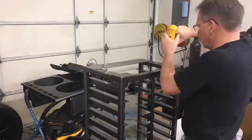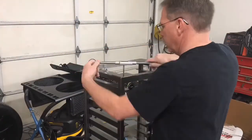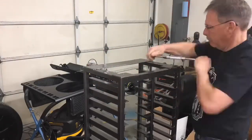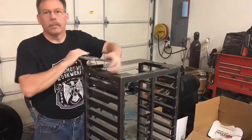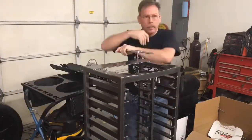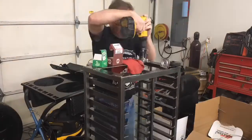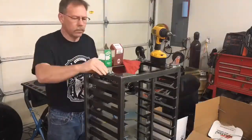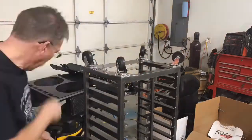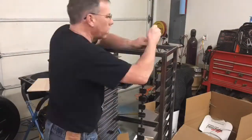Now the rack is back from powder coat. I'd already drilled holes but they weren't quite sized right, so I had to open those up — especially now with powder coat in them — and then I had to tap all of them, so that took a few minutes. Next up was to get the casters bolted on, and these are just quarter-20 Phillips head pan head bolts with lock washers.